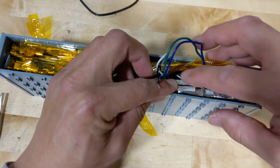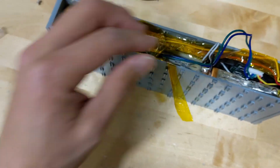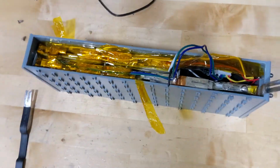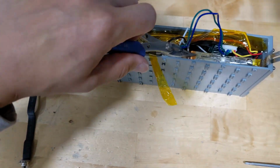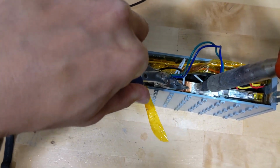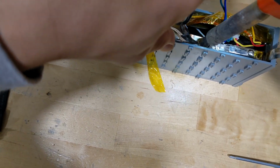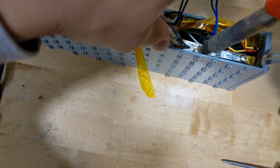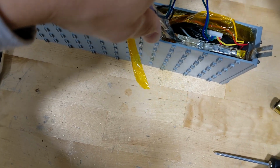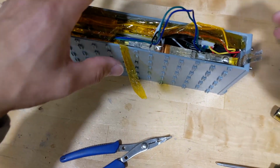Okay. Nothing short. Okay. Then put in the one side of the connector. Okay, and don't use your finger, but a needle nose plier. To melt the solder. See, liquefied it. Nice and saturated. Here we go. That's good. Good solid weld. Move on to the other side.